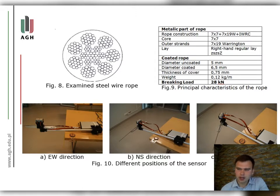The room in which the test was carried out was separated from ferromagnetic steel elements that could influence the measurement or cause disturbance. The instrument was then positioned relative to the compass so that the apparent line connecting the two sensors was parallel to the magnetic north-south NS direction.